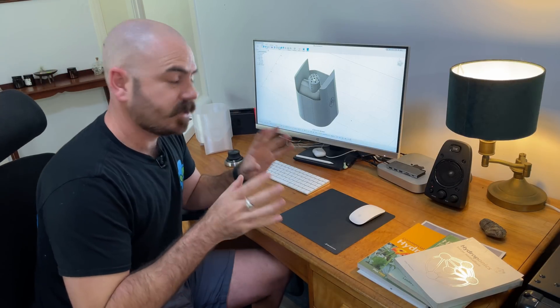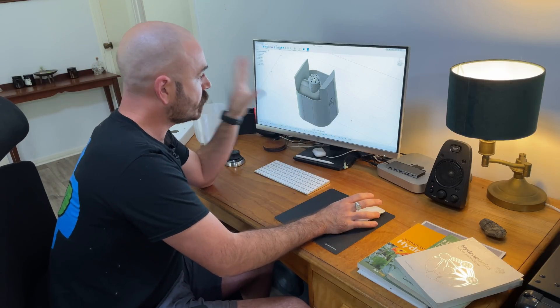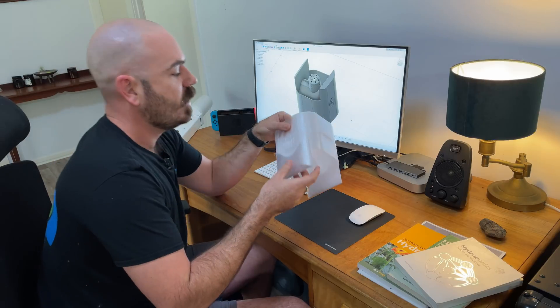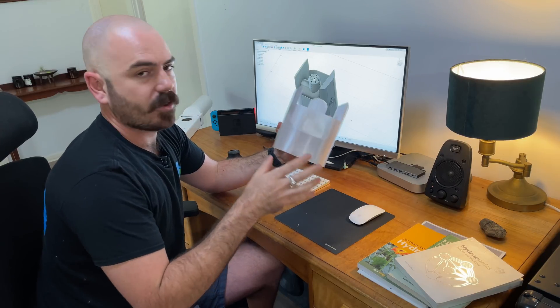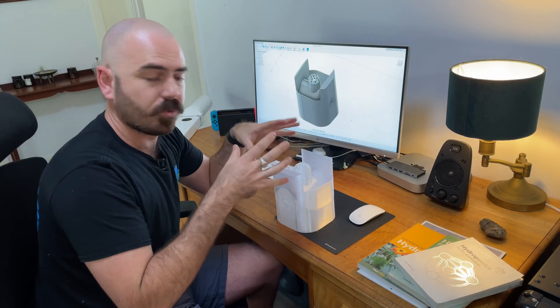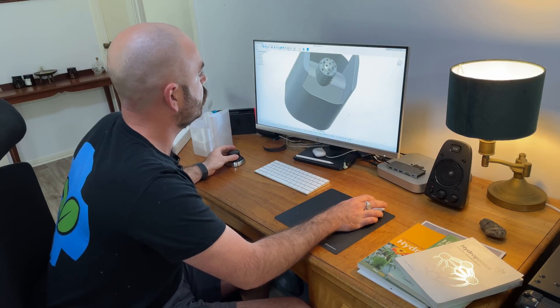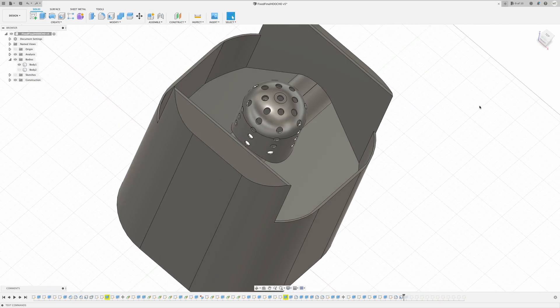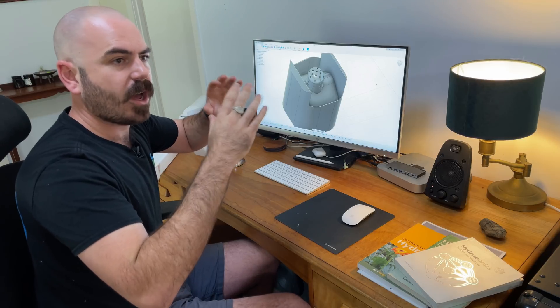So this was actually my first design using 3D CAD technology. I'd never actually used 3D CAD before teaching myself how to do this design, and I've learned a lot along the way. There are a lot of issues I had to overcome in getting this design to actually print properly. Because of the way that 3D printers print, I needed a dome-like structure so that I could print this bucket without supports. The way I achieved that was to have the internals of the bucket come up at an angle that the printer can still print without having huge bridges.